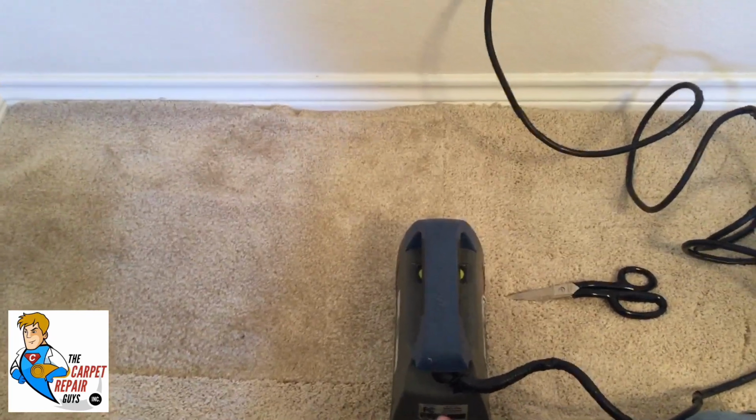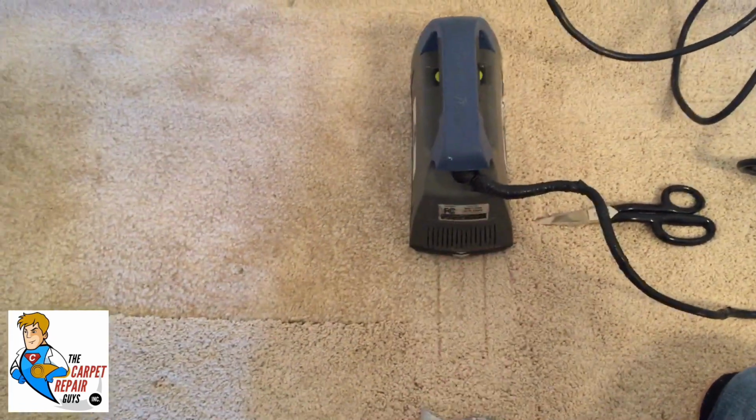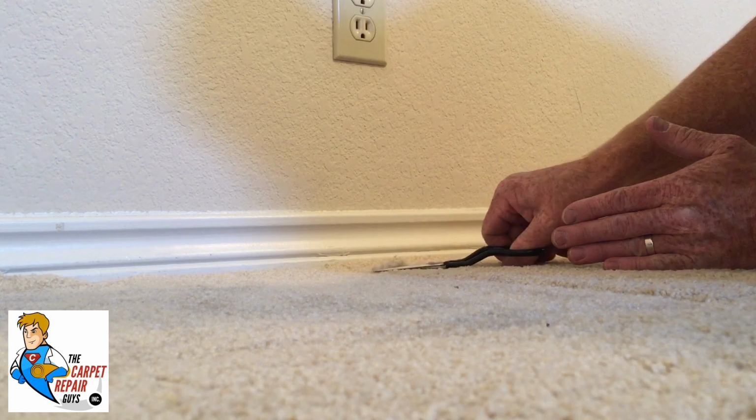This seam iron is hot melting the carpets together. For more on this process, check out our video links in the description. Scissoring at a bevel along the seam lines is an important step in the blending process.